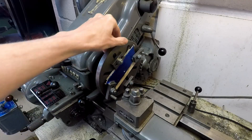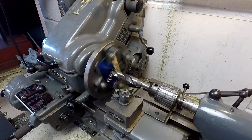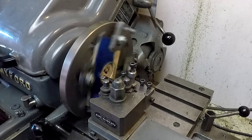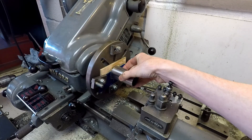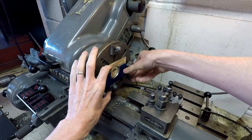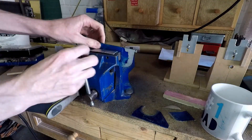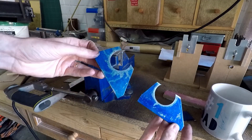Now to look at the bottom bracket. This was made from a steel fabrication. One of the steel plates is now mounted on the faceplate in the lathe, and I'm starting the process of drilling out the large hole which will take the bottom bracket shell. I'm now boring the hole for the shell using a boring tool. Testing the fit on the bottom bracket shell - and it fits. This is one of two side plates that needs a bit of cutting to shape using the hacksaw in the vise. A bit of sawing, a bit of filing, and that job's finished.